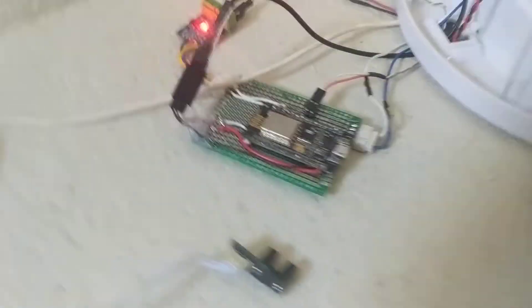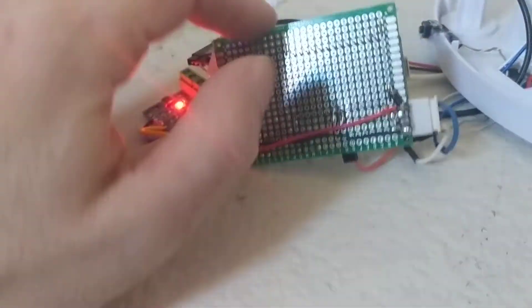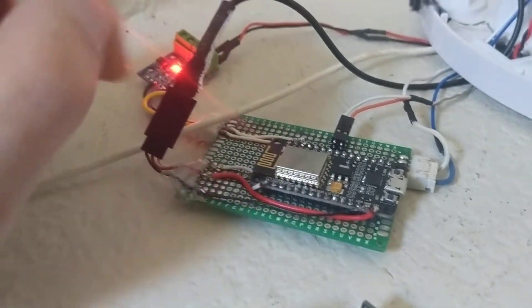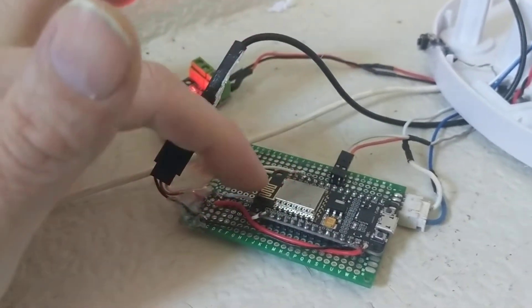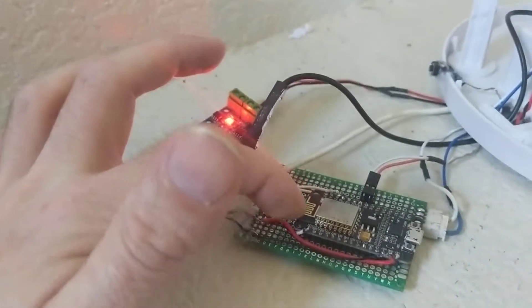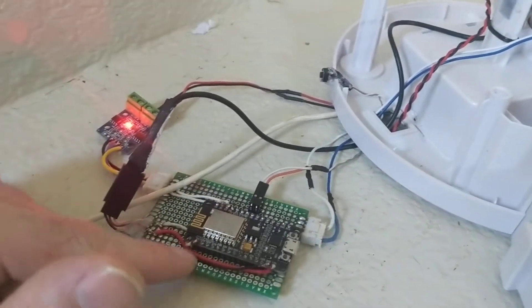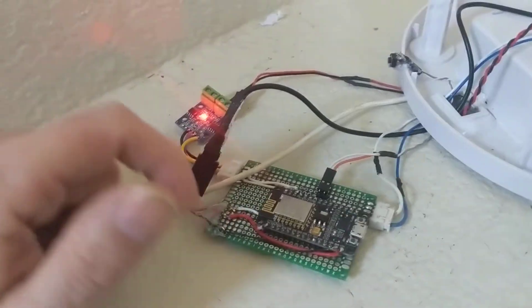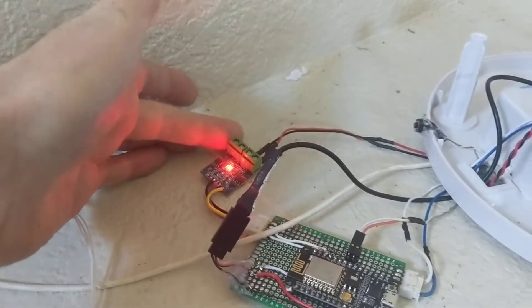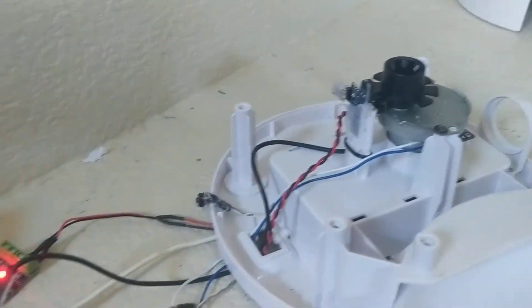This is a NodeMCU with the ESP8266. As far as components on the board, I think it's just one diode on the power input that prevents power from drawing from the board if I have it connected to a computer. So the motor driver pulls directly from external power and doesn't try to pull from USB power. The rest are just direct connections — instead of trying to build my own motor driver using transistors, line level converters, caps, and resistors, I just got this DC motor controller for Arduino. Four-wire, beautiful circuitry on it, works perfect. That directly connects to the motor.